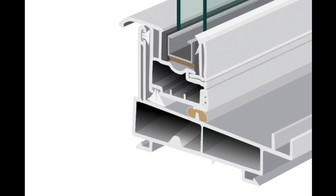As we take a closer look at the corner cut, there are a couple of key features I wanted to point out. You can see this Q-Lon weather stripping goes over the top of this upturn leg and creates what we call a straddle gasket. So when the window is locked and air or water is trying to get into the inside of your house, it has to go underneath the straddle gasket, over the upturn leg, underneath the upturn leg, underneath the straddle gasket, towards the inside of the window. Then it hits something called our structural interlock featured on the lift rail, and it has to go underneath the weather stripping there, underneath the structural interlock, over the inside dam of the window, and then towards the inside of the house.